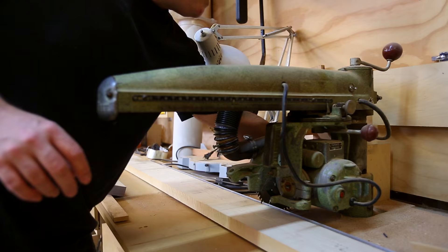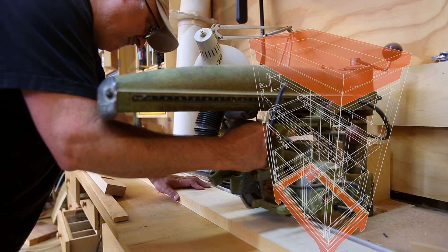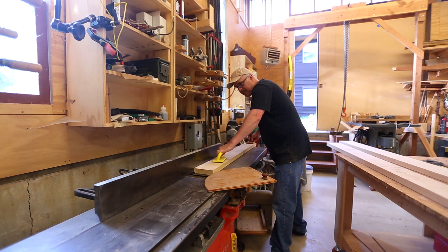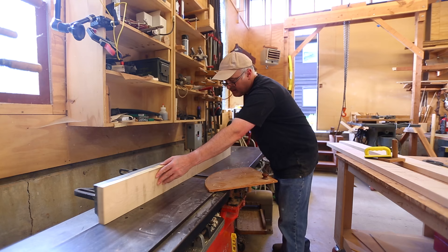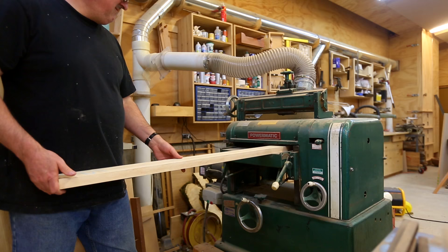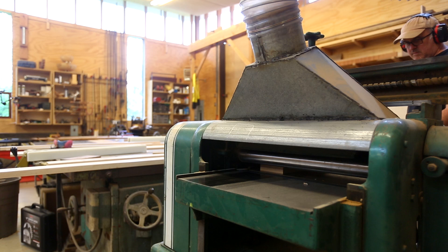For this video, I'll build the little base that it sits on and the tray on the top. I'll get started by building the base of the little pedestal, and I'll make it out of maple. I'll get some pieces of maple ready — cut them to rough length, then joint the pieces, cut them down a little bit more, and plane them to the final thickness.